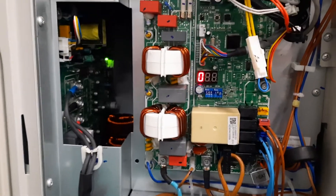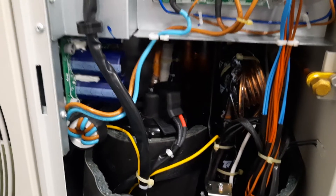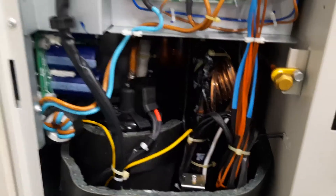There are a couple of things I would look at. Most people would condemn the compressor, but what I'm interested in is: once the unit is cooled down and the water is cooled down, start it up and see if the compressor actually starts and runs.